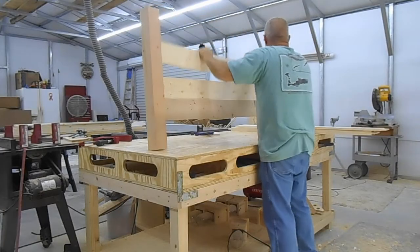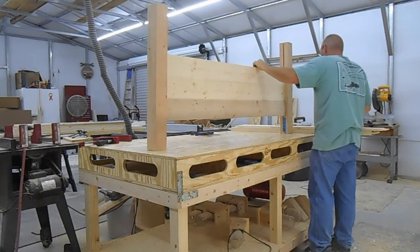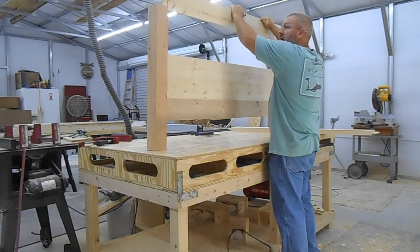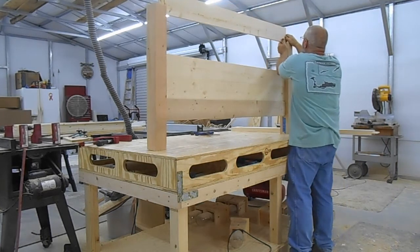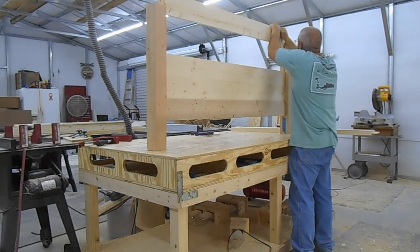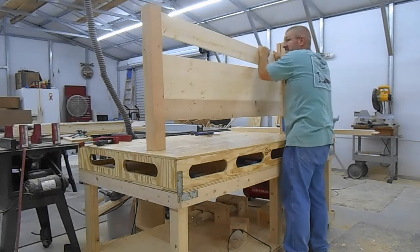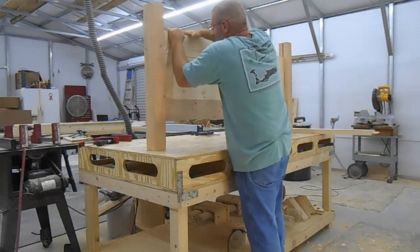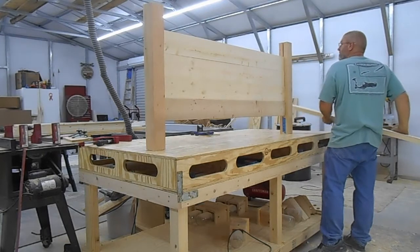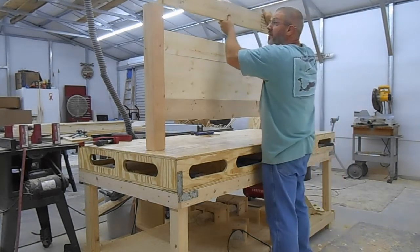The slats just fall down in place and they are not glued, to allow for movement. I allowed about three-sixteenths of an inch overall for movement. The bottom board is glued and the top board is glued, but those in the center are not. It's just one continuous mortise so the boards slide right down in there. I'd encourage you to hit that subscribe button, and this is just a dry fit.